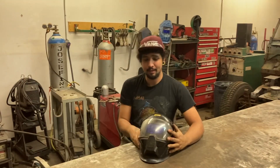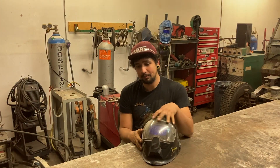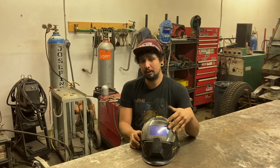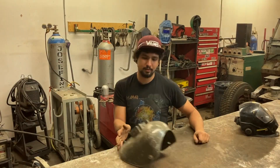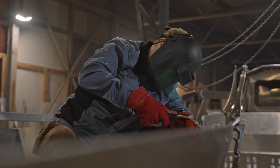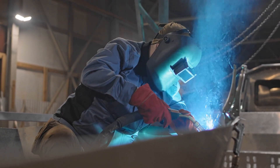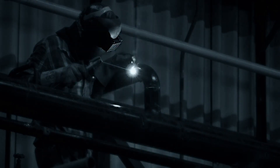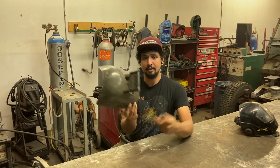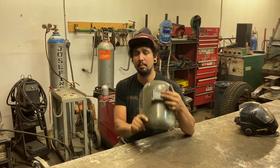Moving up to our last line of defense, and arguably the most important — this is my ESAB auto-darkening welding helmet. What that means is I'm going to be able to see even when I'm not initiating the welding arc. If you're just starting out, you don't need something like this. You can go as simple as a basic shade welding helmet that clips onto a hard hat — it's a great little welding helmet. The drawback is you can't see anything until you start the arc; it is always at a shade 10. It does flip up for grinding, and the price is much cheaper.